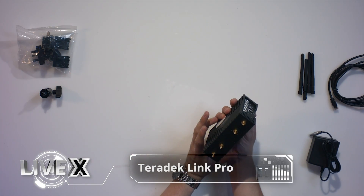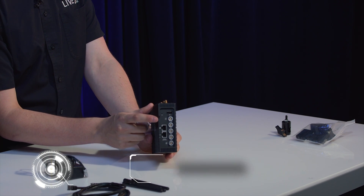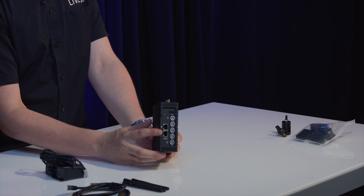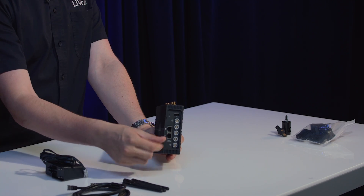Moving over to the side, you can see there's a USB at the top and a reset button, followed by the 2-pin Lemo power port and then 4-pin Lemos. Those are for connecting nodes — Teradek SIM card connections, which are faster than USB. They'll get securely locked in and that's how you use different cellular networks and bond them to get internet. So if Verizon doesn't have good service but AT&T does, you can actually distribute the packets over each of the cellular networks so you'll always have good internet.